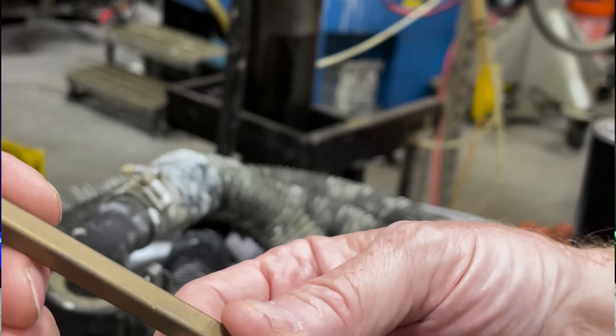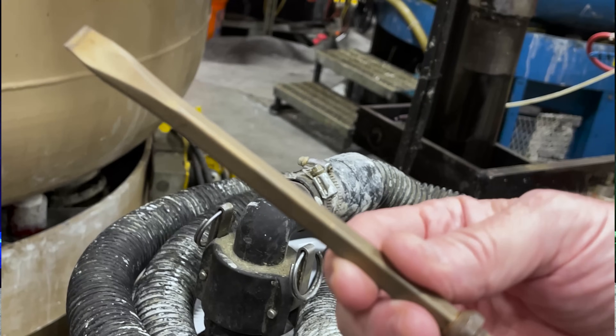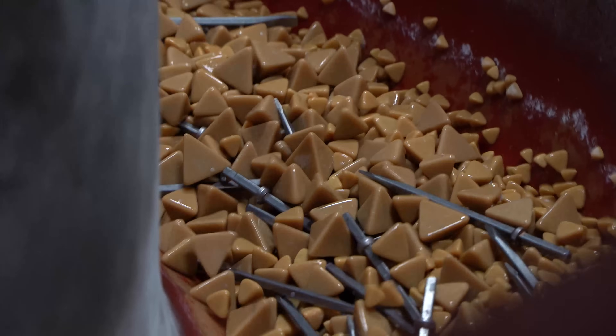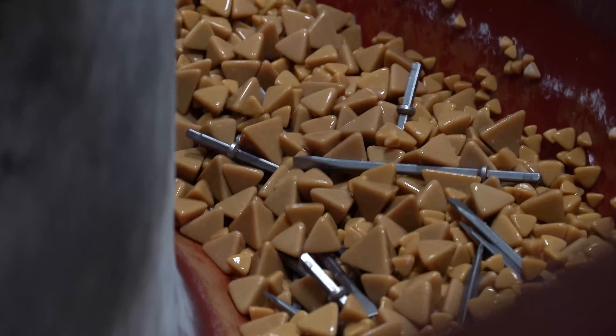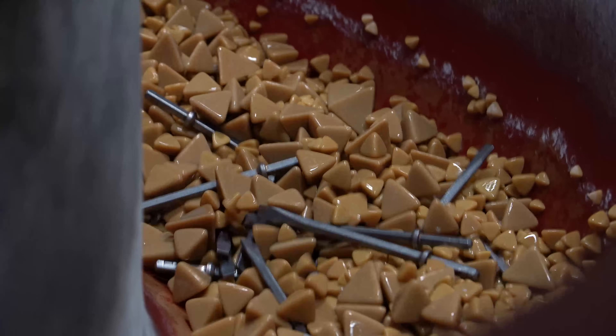It's not just a circular shape that goes inside the handle. In this same process, the tips of the screwdrivers — in this case flathead screwdrivers — are shaped as well, so they get the basic shape. It's not sharp or anything like that; it has to go through a machining process for that to happen. Then in the same process, a polishing happens so that they have a finished shaft that can then be inserted into a handle.